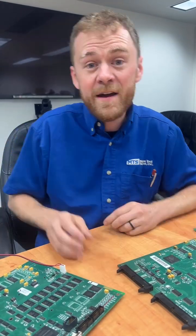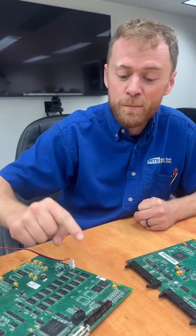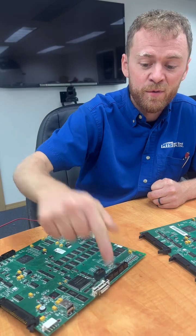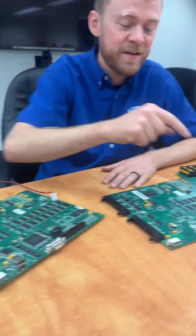If you have MIL version 16 and you have a PC104 card — I may be talking above your head but I want to get the information out there — if your PC104 card is bad, you can remove the PC104 card from the ribbon cables and the power, move your video cable over to this board and plug in your USB and it will work. That won't work on early Coldfire Ones and it really won't work on version 14 or 15. But if your machine was shipped with the network hard drive Ethernet and USB option, you could remove that card and run it natively through here — but not if you don't have it.